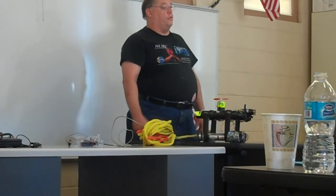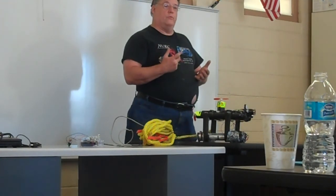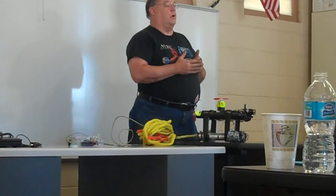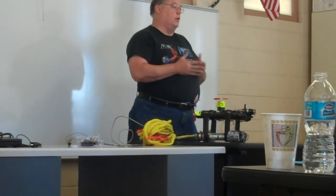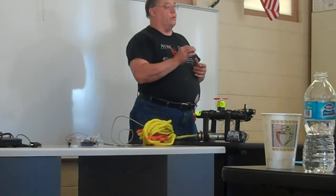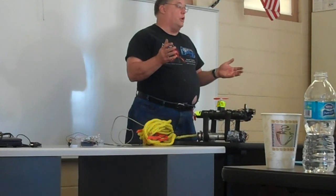And instead of using the standard connector, I bring 3 bare wires out so the water can't push between the wire and insulation. Cast it first, and then solder regular wires on it afterwards and a little bit of heat shrink. Now it works fine in the bottom of the pool.